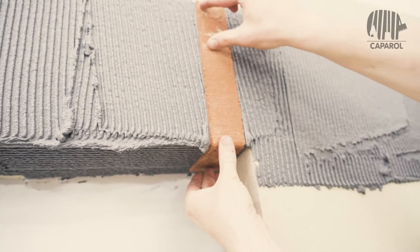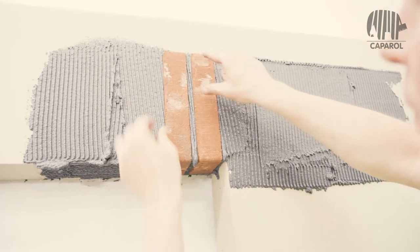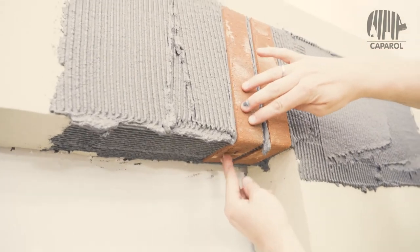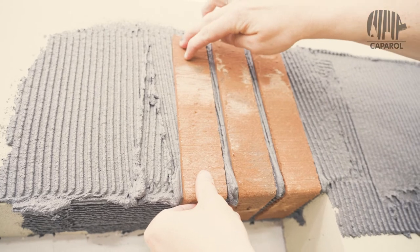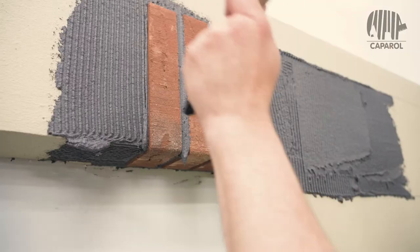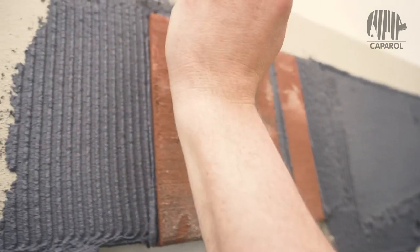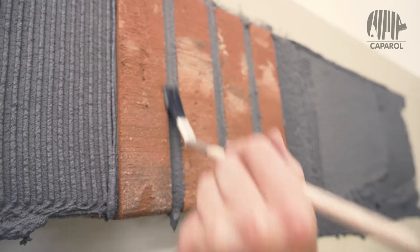Then we start laying our corner facing bricks. We pay attention to the joint, which should be 10 to 12 millimeters, and press the facing bricks into the bonding mortar with pushing movements. And then we apply the joint coat with a 15 millimeter paintbrush. We go from the corner upwards and make sure that the edges of the Meldorfer are 100% in the adhesive. The flat facing bricks must be tightly coated all around so that no water can rinse behind.